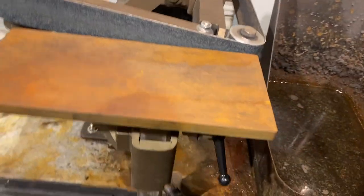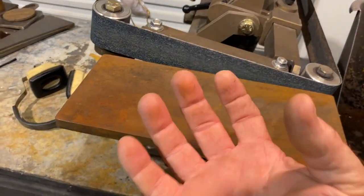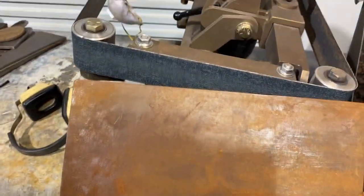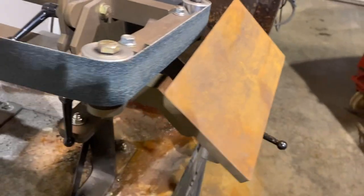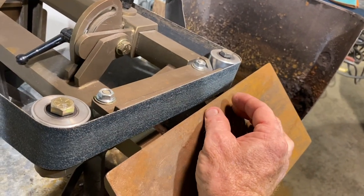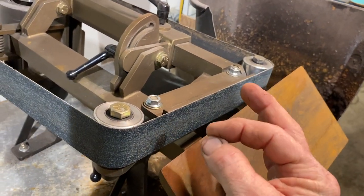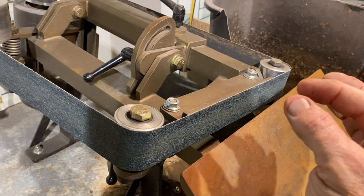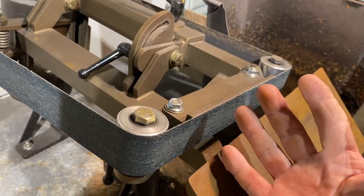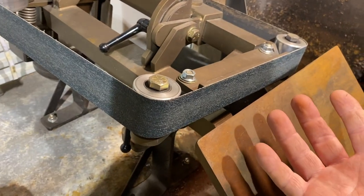It really doesn't take that long. You've got all the pieces cut and sanded down. Then you tilt the sander and it'll push up against there, and you can run them around ever so slightly and get a little facet on the corner — a little bit of a 45 — which gives them that extra dimension. So now you have all the pieces cut.